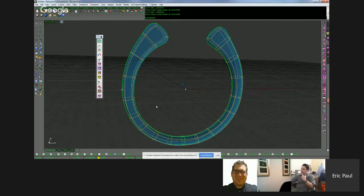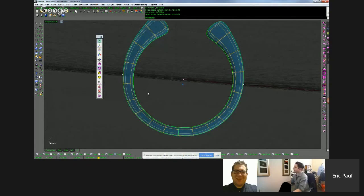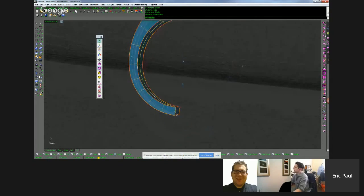I might have to join three or four TS pipes together though. If you're doing a sweep ring with T-splines and use TS pipes, if you draw from halfway around the ring, so halfway around the shank, and then go up to the curves, is there a quick way to join all four together, or do you have to delete the faces individually and then use TS merge? I always delete the interfaces and do it, like you say, with a set point, and then you can just delete everything and do one and add symmetry, if that makes sense.